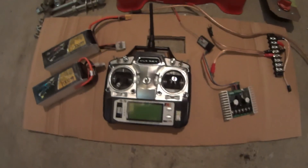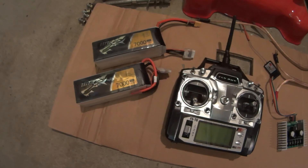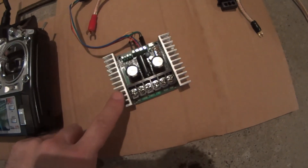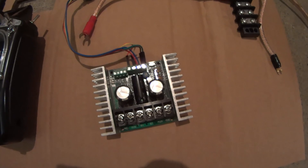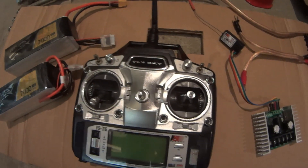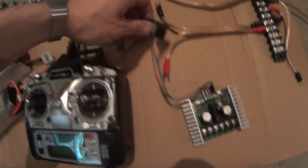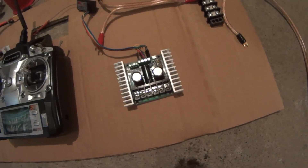I really wanted to talk about this electronics section. I've squirreled together some drone supplies — these are 7,000 milliamp-hour lithium cells, 6S batteries. The Sabertooth 2x32 motor driver can take up to around 30 volts, and I remember it'll take input from these 6S batteries straight, no problem. Instead of big lead-acid batteries, I'm going for a lightweight mower this time — hoping that if it's lighter, it'll just maneuver better. The radio transmits to the receiver, which is wired into the Sabertooth. The Sabertooth interprets those signals and drives the motors with the appropriate output.